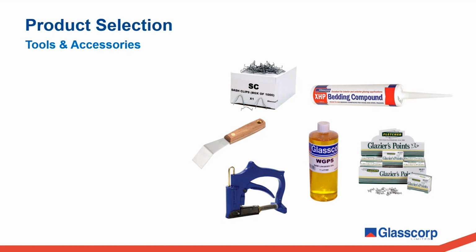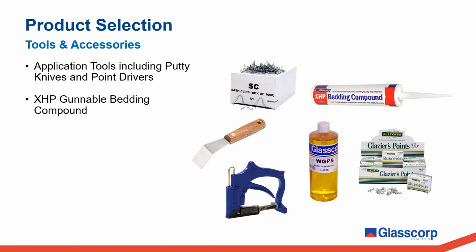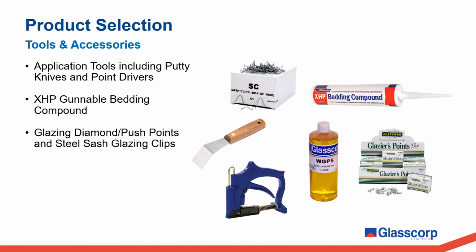In addition to glazing putty, we also supply a range of tools, fastenings, and base components. These include application tools such as putty knives and point drivers, XHP bedding compound used to bed in glass for both standard and XHP putty installations. We sell diamond points and push points for timber framed installations and steel clips for steel frame applications. We also supply a few base components such as raw linseed oil and whiting powder.